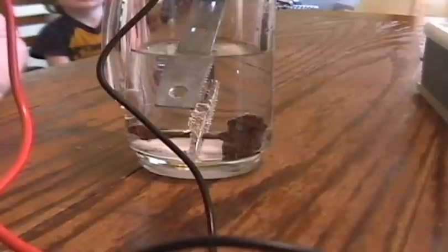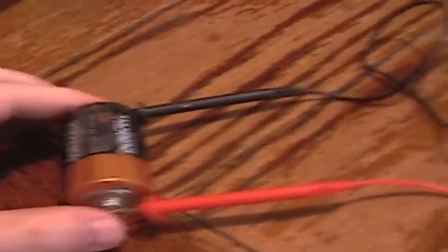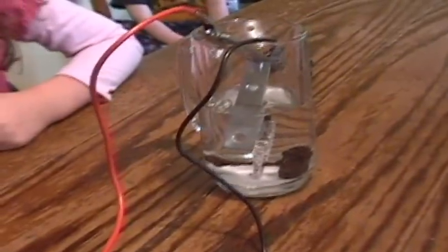So what did we do here? What's going on? So we're trying to clean off all the rust, and we found it in the dirt when we were planting stuff. We've already touched it a little bit, and you can see some of the rust is falling off. So what we've got here is a battery and some tape, some alligator clips that are currently not connected, a sacrificial piece of metal on the positive, and a piece of metal that we want to clean on the negative.